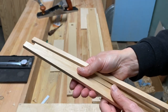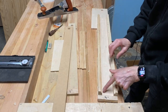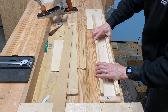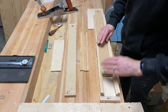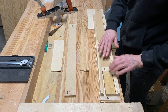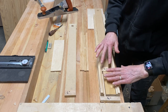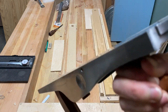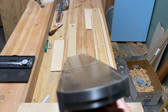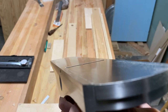Especially with maple it's a little bit more difficult. So I have those all oriented the same direction. In my planing jig, I first want to make sure that I don't have any little bits of shavings in there that are going to change my depth. Because I want to make sure that I'm not dropping the plane off on the end, I've put an extra spacer block down here. That allows the front edge of the plane to ride on the rails a little bit longer so the blade is definitely clear of my work. You can see I hardly have any blade protruding at all — you look down the front edge of the plane and that's about how much I have sticking up. It's hardly any at all, almost flat, just a very, very tiny bit.